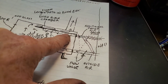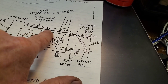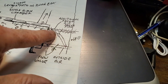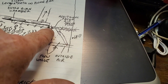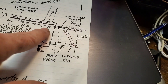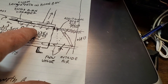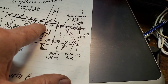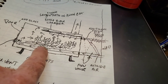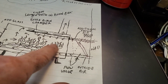Up here I want to add a second piece of sheet metal, and underneath that sheet metal, another pipe with little holes in it that also comes from outside air with a throttle. Both of these air inlets have adjustable valves. When you get everything going really well, this one introduces fresh oxygen up at the top where all the gases come off of the smoldering wood. You can burn the fire a lot lower and then get a bunch of extra combustion up here when this is working well.